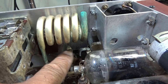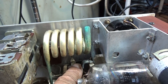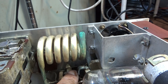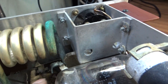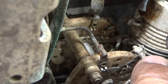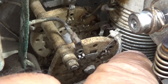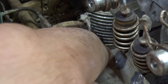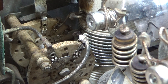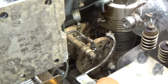Less turns for more tubes. It comes in, one, two, and then three, and you can see this tap under here that goes to the band switch. So when you're on 10 meters, all you're using is these three turns of the tank coil. Then as you go to 15 meters, two more coils, and it taps right here. Then it goes to this coil down here for the rest of your bands — 20, 40, and 80 — and you need a lot more coil for those, so you've got this more closely spaced coil there to give you more inductance for the lower bands.